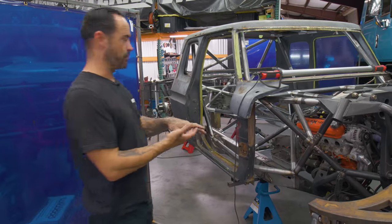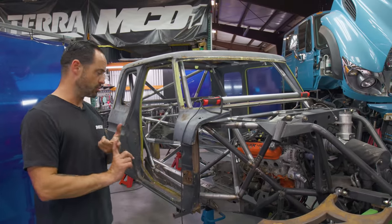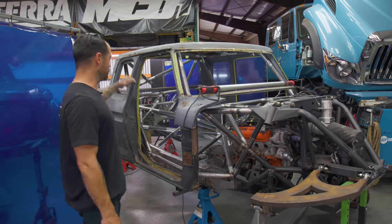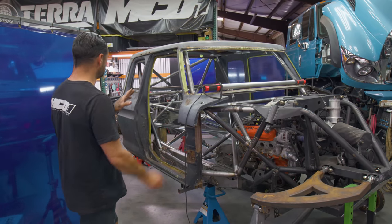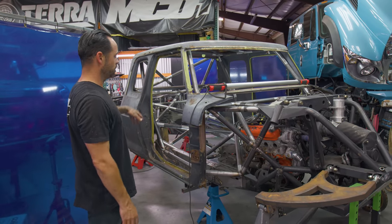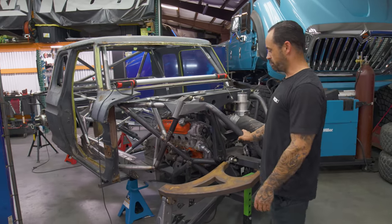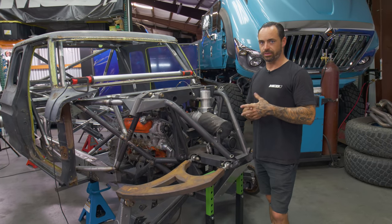Just for a short recap on this thing. Eric's truck came in, first gen Tundra, center mount, front bulkhead. Quite a bit of frame rail, I would say 6 to 7 feet. Then like a 2x3 rectangular mild steel tube chassis going out to the bump zone and to the fuel area and all that. Like we talked about before, doing an extra cab F100 cab swap on this thing was the big ticket. Making this thing removable was also the intention here.